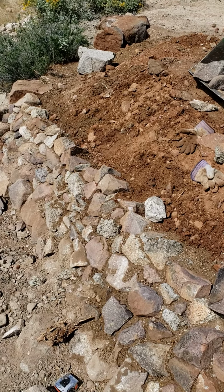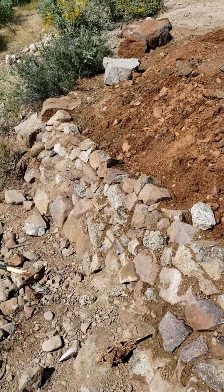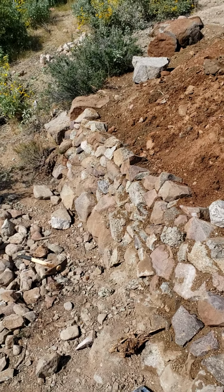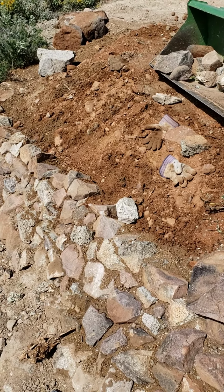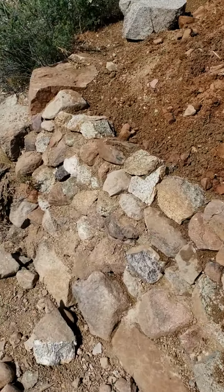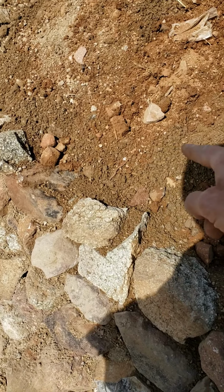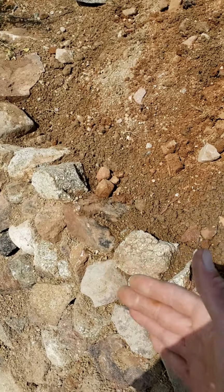If you were to go into the engineering of it, you divide your weight by the total area at 45 degrees. There's a reason that retaining walls aren't allowed more than that: if you were to drive a car right next to this, you would be pushing outward on it. We're using gravity to our advantage. Not every rock is positioned in the deeper direction, which does make it stronger. But gravity's helping us here.